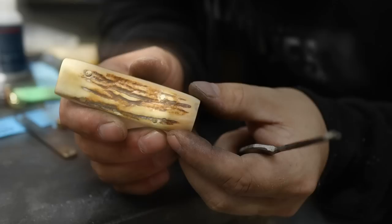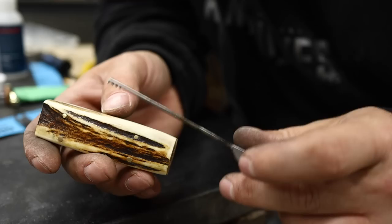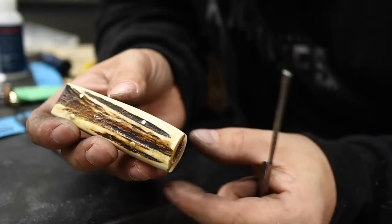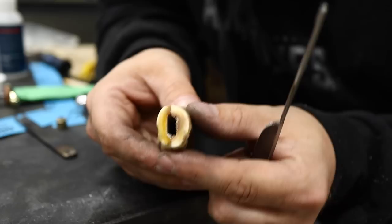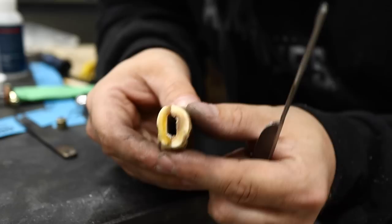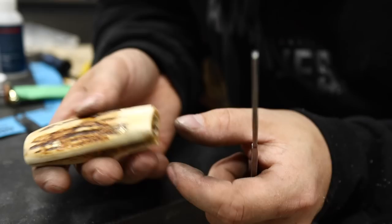Until you're in this game and you've come across all the different scenarios of things that can go wrong, you realize how valuable specialty tools are. You wouldn't think there's no way to open this up. How would you open up this keyway without something like this? A drill bit can't really do it sensibly. You definitely can't cut it from scratch. You don't get milling cutters that long where you could put it in vertical and side cut it. A file would take forever and they're usually too thick. But this tool right here...